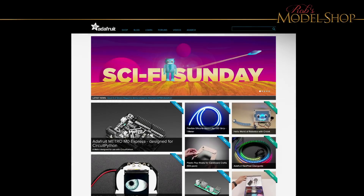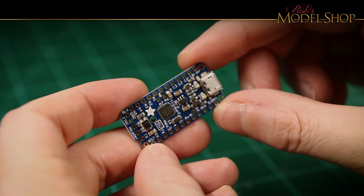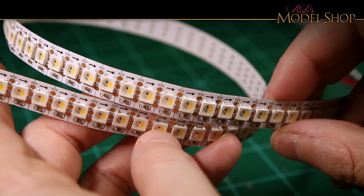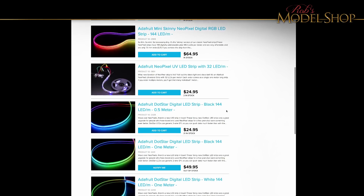In this episode, we're going to be making an LED backlit sign in honor of Avengers Infinity War coming out on video this week. I'll be controlling the sign with a 5-volt Trinket Pro from Adafruit. Normally you would be powering these externally, but we're only going to be running about 20 or so LEDs, and it's going to be just fine powering those LEDs straight from the board.